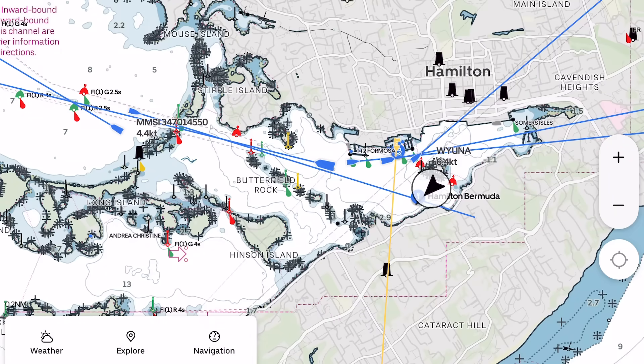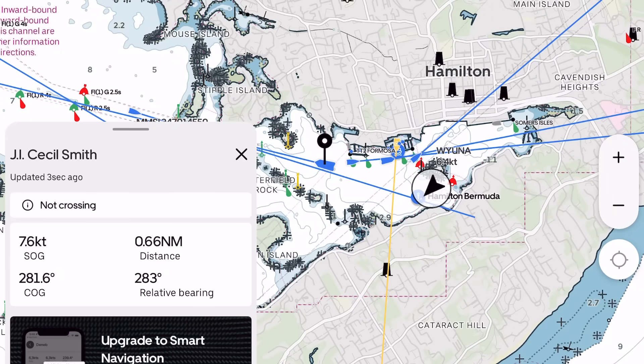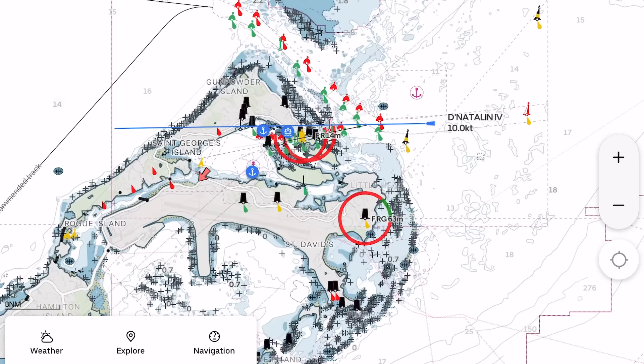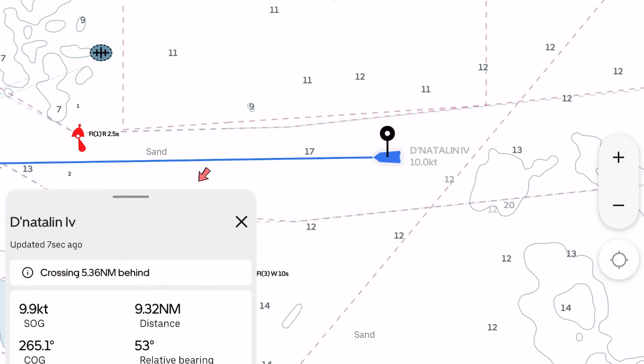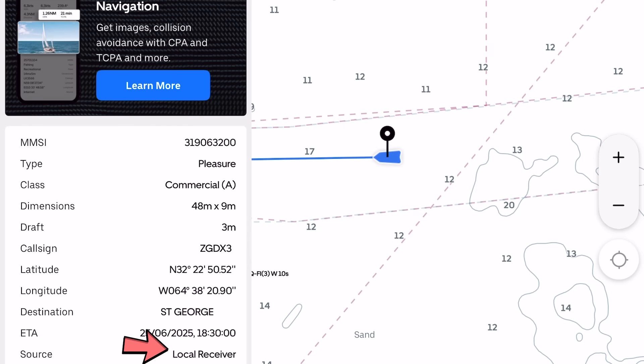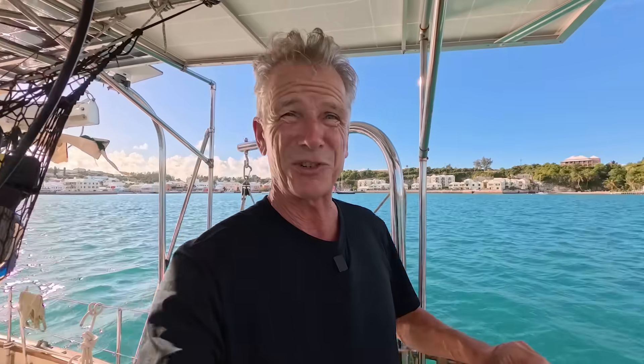Of course it's not just about the figures — it's about what you can see. We've populated the sound here in Bermuda with lots of boats, so that's good. And if we look further afield, the other side of the island, there's someone approaching the cut — they are 9.3 miles away. I just want to check that we're not getting this over the internet, and as you can see it is on local receiver, so that's good. Very glad that seems to be working really well for the Atlantic crossing. Having another aerial down here is a good redundancy thing as well — AIS and VHF aerials are pretty much interchangeable, so if the worst happened and we lost the rig, I could just take the plug out the back of the VHF and plug this aerial into it in an instant.